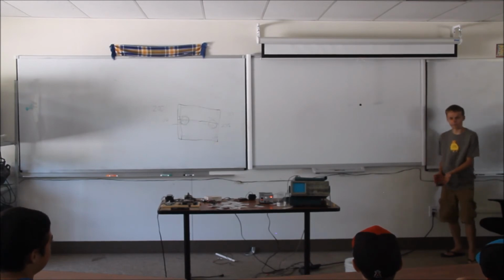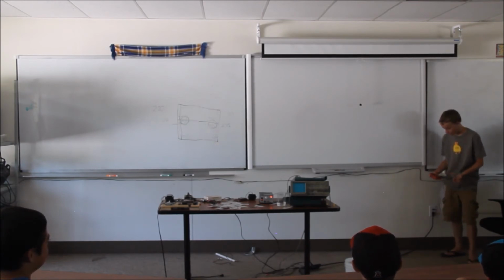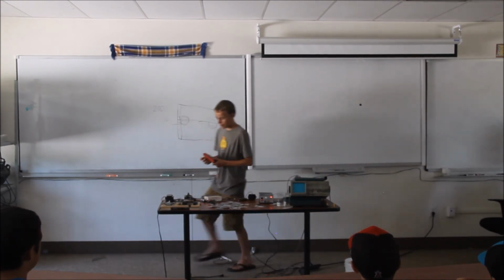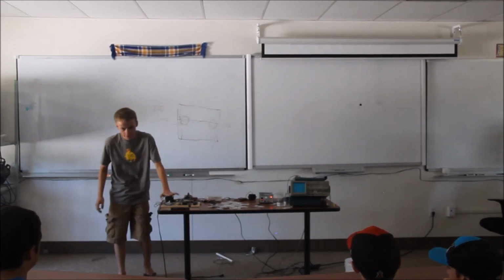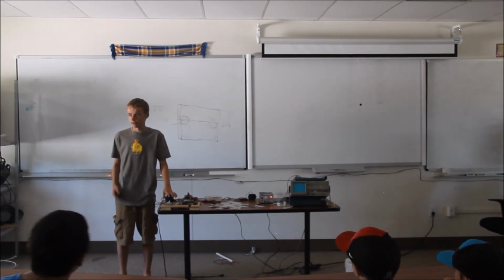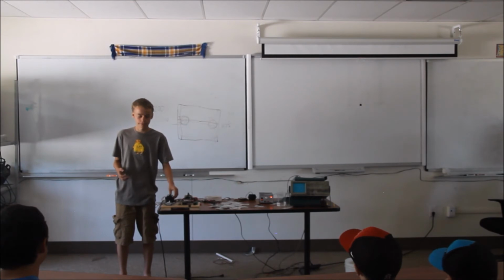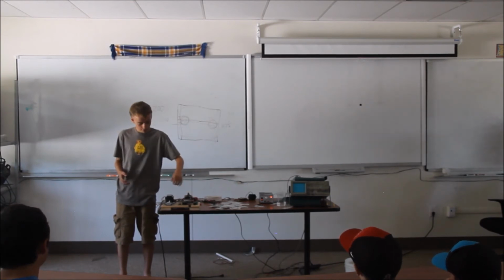And sometimes they put out more power than others. But right now it's going 117 volts AC. And now, this transformer on my power supply is a transformer that steps that 117 volts down to 40 volts to power this circuit right here.